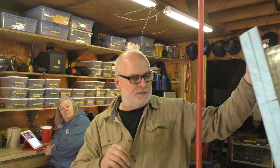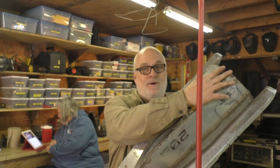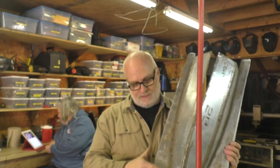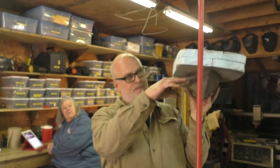This is not called a delta pad — some people call it a delta keel, somebody informed me of that and they're right. We're gonna put a delta keel in. Somebody else noted that it's completely flat and said water's gonna hit it and slam into it — kind of like a catamaran salon deck. He's thinking about angling it down. We'll build it like this but we can always come back and do that. We also did a buoyancy test — go back and look at the first video called 'Diesel Jet Boat Part One.' We put it in the water at scale with weight and we know exactly where the waterline is going to come on the real one.